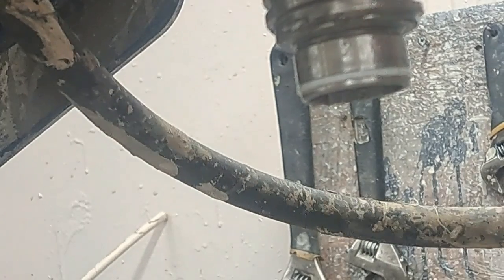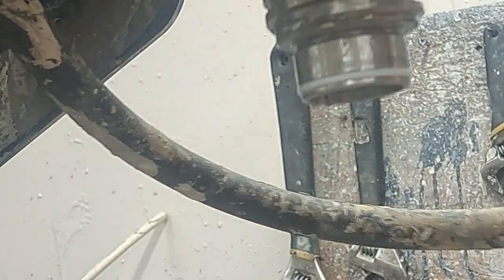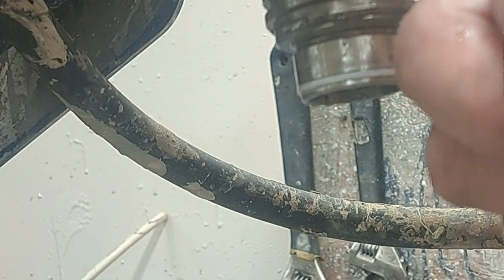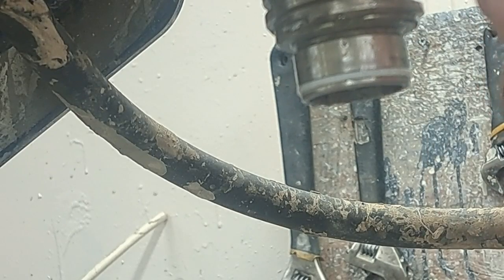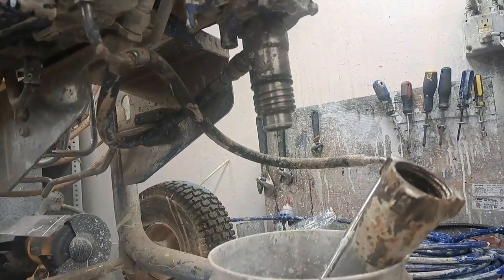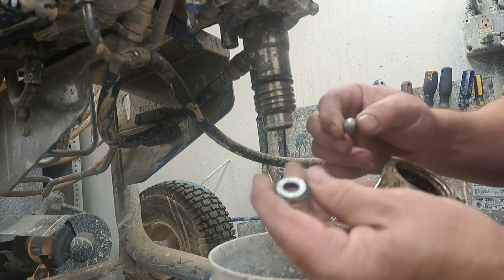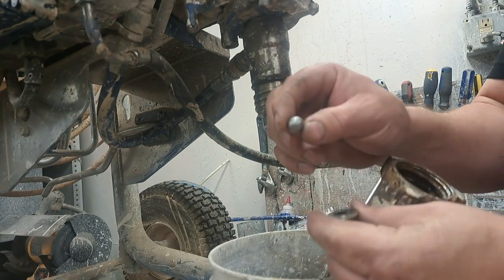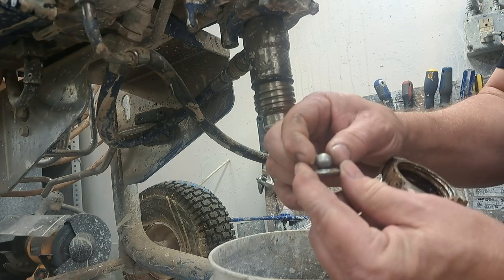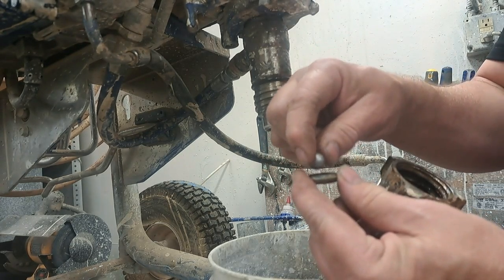The way this works: your upper and lower ball move, and there's another ball on the piston in here. This ball is supposed to sit right here — when the piston goes up, it siphons up and brings material in. When the piston comes back down, it pushes down and seals it off. So this is an open/closed valve. The seat is what the ball sits on — piston goes up, sucks the ball up just a little bit, brings material in, then when the piston comes back down, this ball goes down.